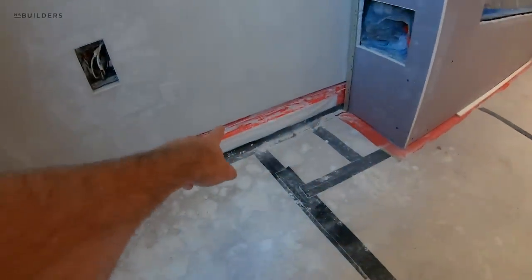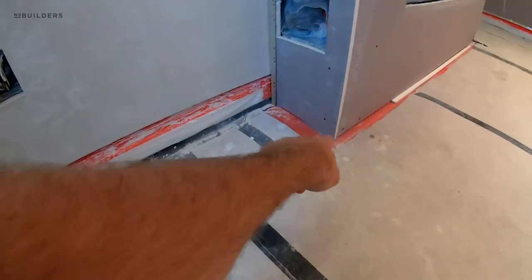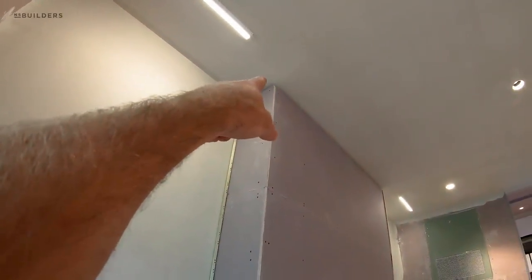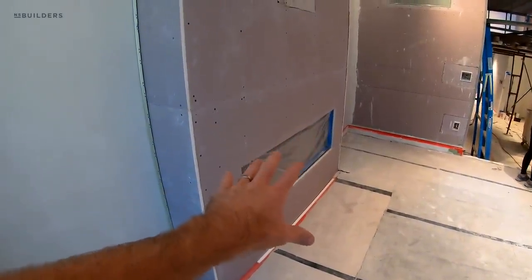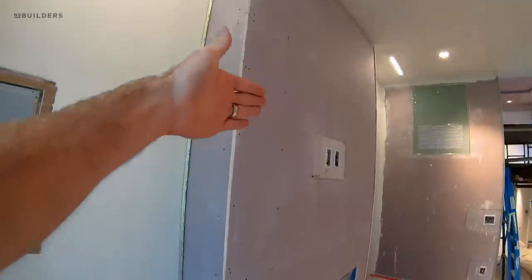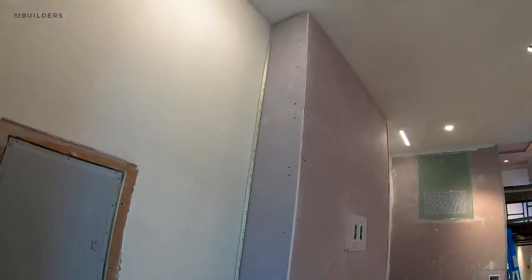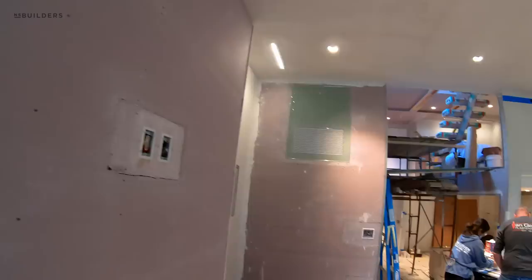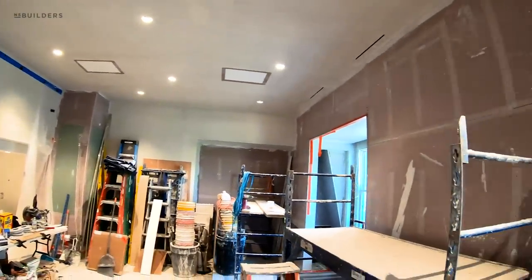And you know, we have the half inch gap at about 4 inches up for our baseboard. We'll do a half inch gap there. And then a half, actually that's, I believe, close to an inch. And that inch is actually our heat release for this fireplace. So not all the heat comes off the front of it. Some of it goes up through the duct and then across that ceiling to help basically shuttle the heat out of there. So start with the ceiling and then work into the walls.